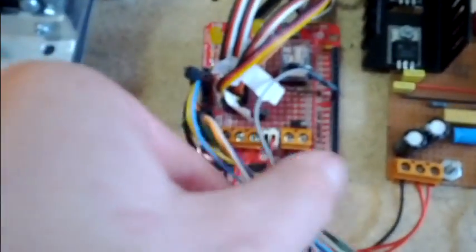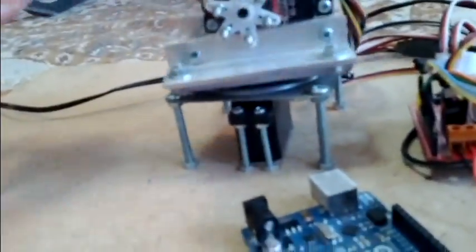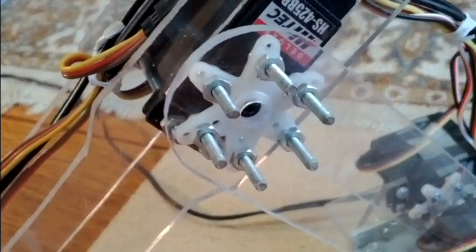All these servo cables go up to the structure of the arm. We've got a joint there, joint there, joint there, joint there with two servos, and a servo underneath where it pivots around. It's clear acrylic cut out with a coping saw, bolted together with little 2.5mm bolts. There's an electromagnet on the end, and a little servo in there to rotate the electromagnet, which is kind of useful.